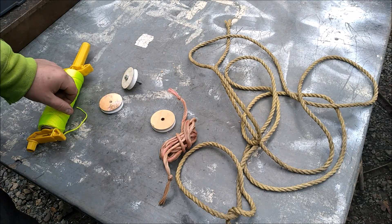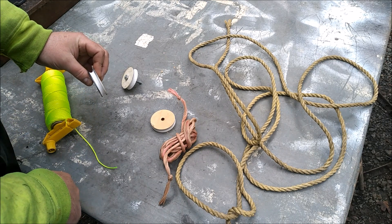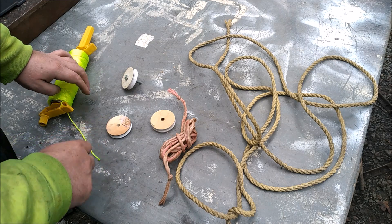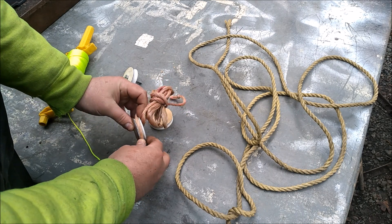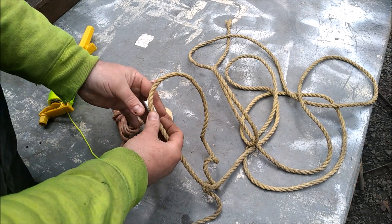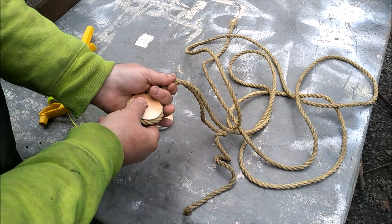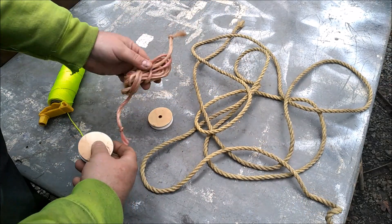What kind of rope or string are you going to use with it? The thinner the string is, the more it's going to cut into the pulley instead of making the pulley spin correctly. This kind of construction twine string is probably too small to work with this stuff. Now if you had some baling twine, that would work pretty good — it won't cut into it too much. Basically, get the biggest string you can find that still fits in there — it's not going to cut down to the bottom of the groove, it's going to rest equally in all of it. I think that would work — something in between those two sizes would be perfect.